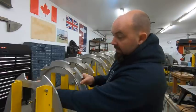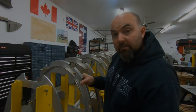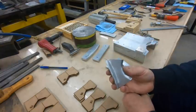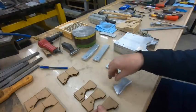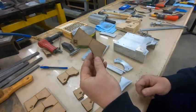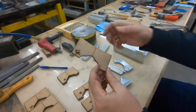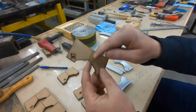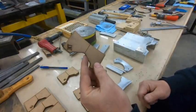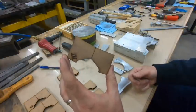There are four of these splice plates. The top two are mirror images of each other but not necessarily symmetrical, and it's the same thing with the bottom ones. With the exception of frame K, I've started with the rear seven frames on the Typhoon. Just like I did to make the templates for trimming the frames, I went back to the form block CAD drawings and basically spliced the frames together — got rid of the extra inch, divided on the center line of that stringer cutout where the joint is, and created a very small template to give me the proper curve for these form blocks.